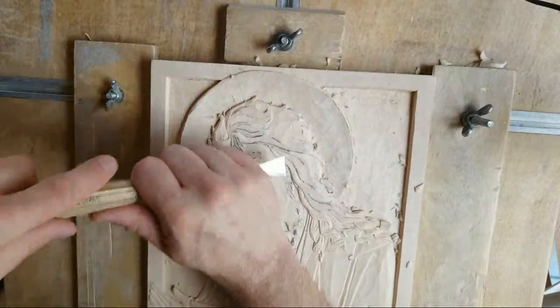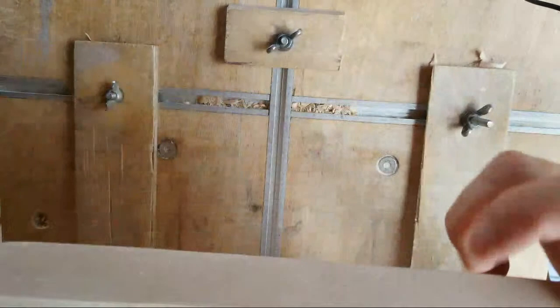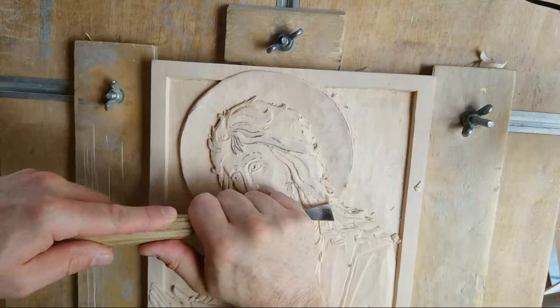And this was when I just started doing this kind of professionally. And what I didn't realize is that I had to carve this ornament in the head of the grain. The head of the grain means the top of the grain, where the grain comes up like this. And my goodness, that was just insane. I would never do that again. It took me forever, and it was so painful. So if you're going to carve maple, don't carve in the head of the grain.